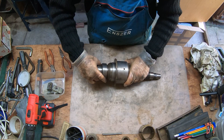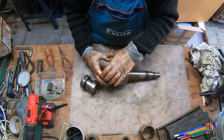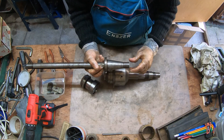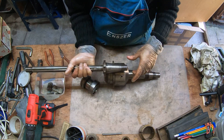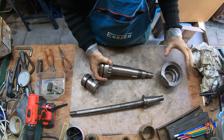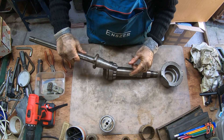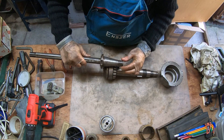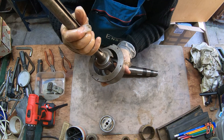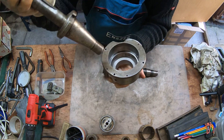It's spinning this way and this is the tool holder at the end. What I'm trying to do is to convert the head into an International 40 taper, so it accommodates International 40 tooling. I've done a few checks, I've done a few measurements, and it looks to me that I can hog out enough - I have enough material in the shaft to accommodate the International 40 taper. I think it's gonna fit perfectly over here, just like so. I think I've got enough material and enough room, so that's my plan of attack.